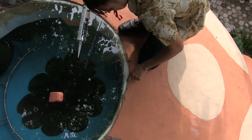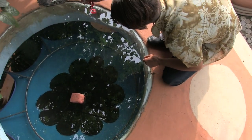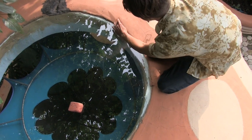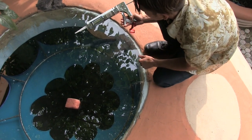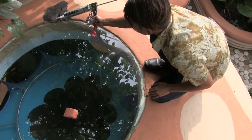We have a leak - I can see this step here. We made a trench for the water to come out, but this point is still a bit high. I think this point needs to come down, and we might need to do another trench here and another trench there - but lower than the glass, in line with the glass, not stepping up like this.